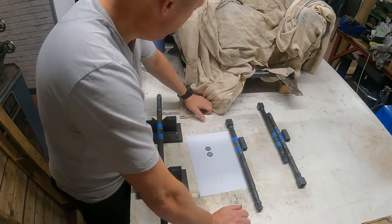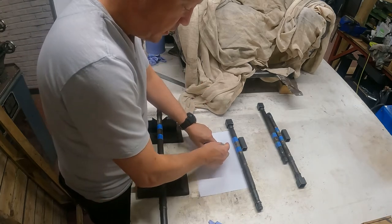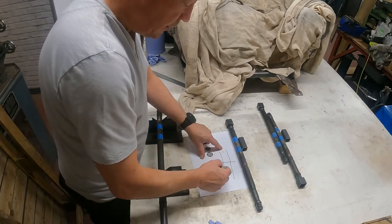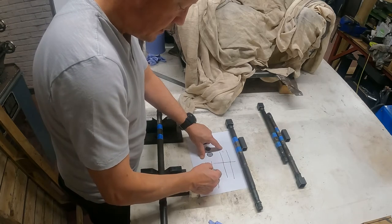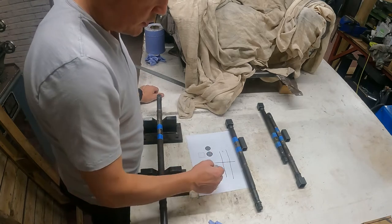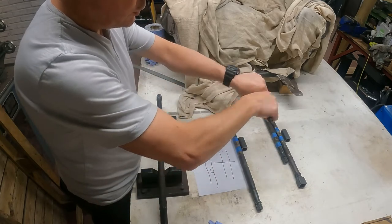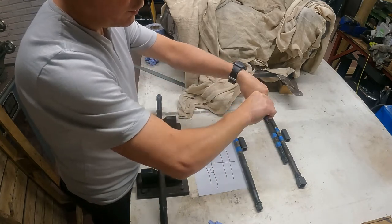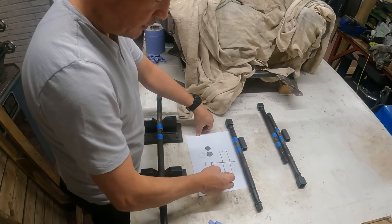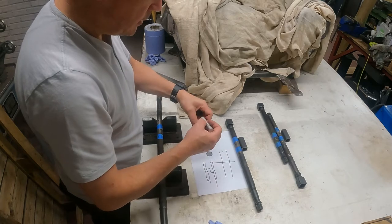And I've also seen them where they've been toothed. And what I mean by toothed is, instead of just taking the shaft and slicing it, they cut it in a notch fashion. So when they come to weld them together, instead of having just two shafts trying to break apart, they're actually bearing on top of each other, and then a cylindrical piece of tube just goes over the top to reinforce it.